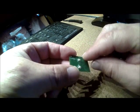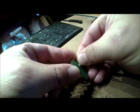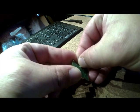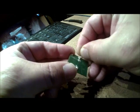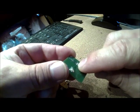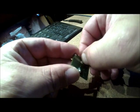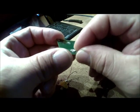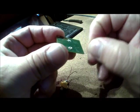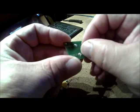The first thing to do is remove all this silicone — this is protection for the wires that were on there. When you remove it you can see the other end of the wire that we have to unsolder. We're going to use a device called the solder sucker to do that and get those pieces of wire out.